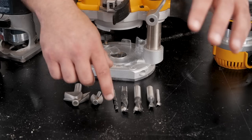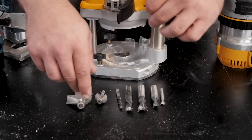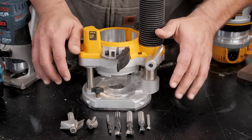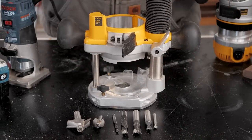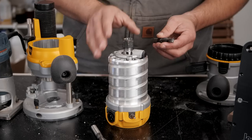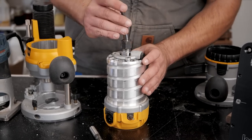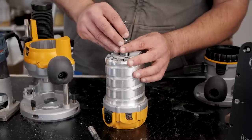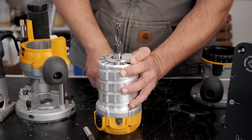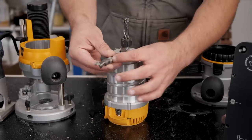One of the best ways to accomplish multiple depth cuts with straight bits or even a bearing-based bit when you want a large edge profile is to use a plunge base router. A plunge base allows you to lock the router in and move it up and down. Also, when putting a router bit in a collet, never have more than half the shank outside of the collet. I usually bottom it out or pull it out just slightly so the cutters don't go below the collet, because you don't want to dull your cutters.